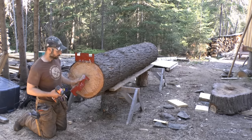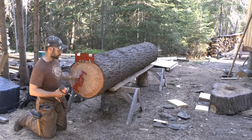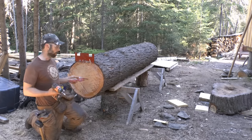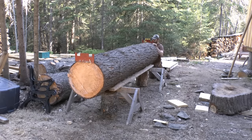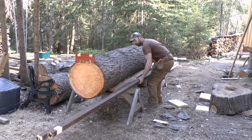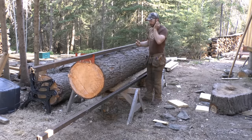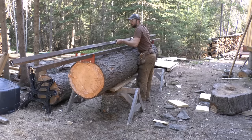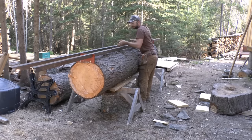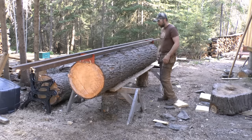If there was a difference between my butt and my tip — this is the first time I've had essentially no difference — I would drop it farther at the butt to accommodate for that difference so that we're centering right in the log. It just produces a little bit more quality lumber, or a greater quantity of quality lumber. I'll drop my rails into position. If the log isn't well braced or it's a smaller log, adding this weight to one side could roll the log, so I always make sure to have it blocked up. I'll just check that the rails aren't sitting up on a high piece of bark anywhere — I've got good clearance. So I'm ready to cut.